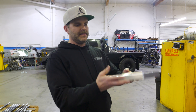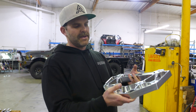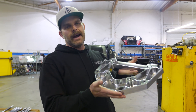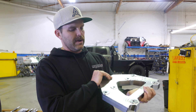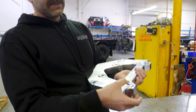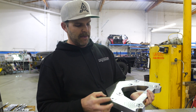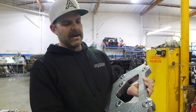Today we just got the steering rack adapter plate — this is a big billet chunk of chromoly. This will locate the steering rack in the truck. In the past we've done them out of welded sheet metal, but there's so much load going into the steering system in these trucks that you develop a lot of cracking over time. The best way is to make a nice solid billet plate like this. One thing we do a little differently is we put these little raised bosses where the steering rack meets up — we started doing that because the sheet metal would distort slightly and when you bolted the steering rack up, it would put the rack under tension. These small indexing pads let the steering rack sit on them, so when you tighten it down it stays flat and reduces any tension.